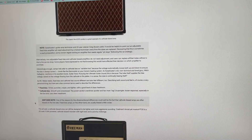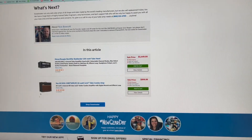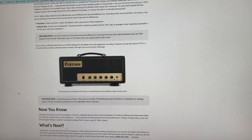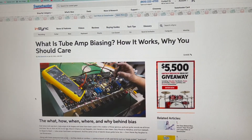With some of those amps you will need to pay someone to bias them in a specific way so you don't damage your amp. One cool thing I found was Mesa Boogie - they have their own tubes specifically made for their heads and amps, and it's just plug and play even though they're 50 or 100 watt amp heads. I thought that was pretty cool and worth sharing. Sweetwater has a great amount of information. A lot of the chat forums are saying the same thing, and it was just a great write-up from the source itself.